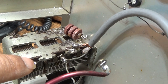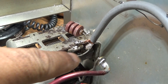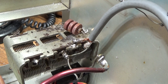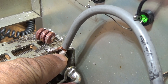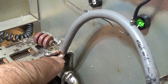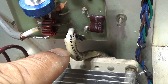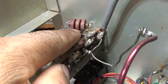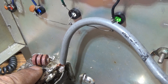This one section is not connected — it's not needed for 10 and 11 meters. If you hook that one up it might actually mess up the tuning because you'd have too much capacitance. So just use those two sections. Then this piece of coax is just the output — it's finished doing what it needs to do. The output goes over here to the meter, and the other side of the meter goes to the relay.